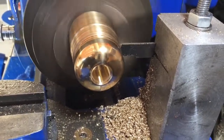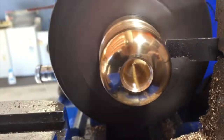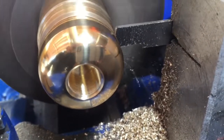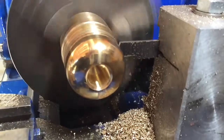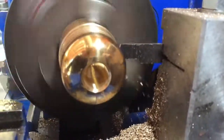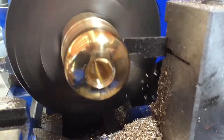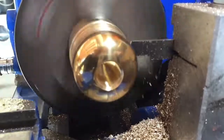The tool itself can be cut away — for example a half-inch wide high-speed steel blade that's been ground — and by grinding you can alter the height above center of the tip. You may be wondering why I made this out of aluminum: it's merely a matter of having the material handy and wanting a very large block of metal to make it stable. I had this large block of aluminum and thought it'd be easier to mill than mild steel, though mild steel would probably be more suitable. We had extensive discussions on the Boxford Users Group about parting tools and what techniques work — this seemed the best option to me, and I'd recommend looking at the Boxford Users Group for that discussion and extensive information about the Boxford lathe.